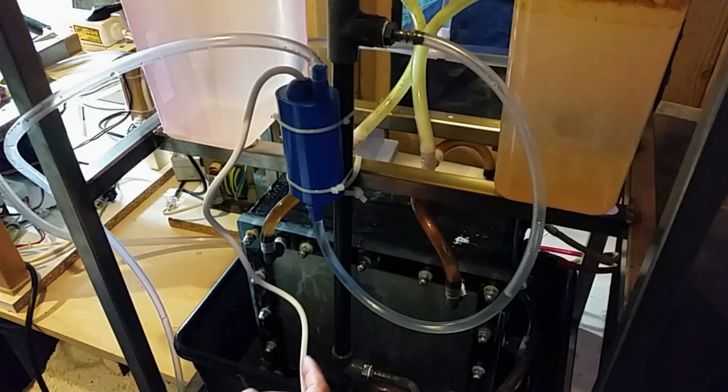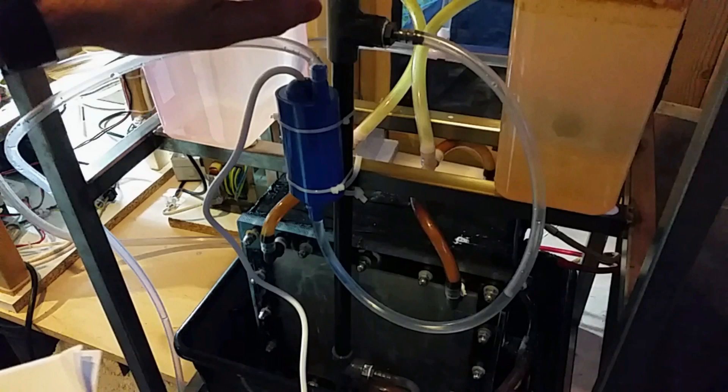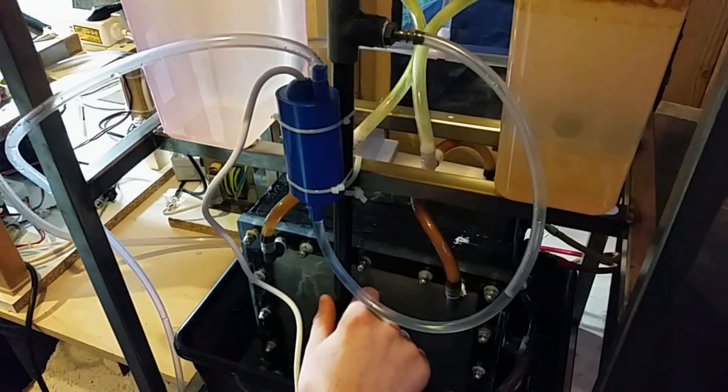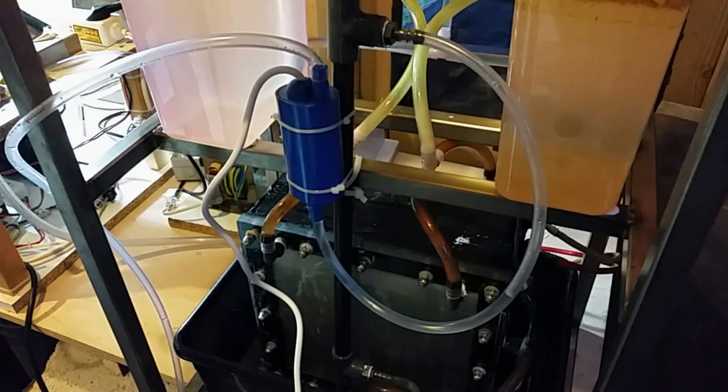To solve that problem I added this cooling tube, which is just a stainless steel pipe for the water to flow through. The return water from the tanks flows through this hose and at the bottom flows back into the generator. The stainless steel pipe has some PVC tubing around it for the cooling water to flow through, so the pipe and therefore the water will be cooled. The water flows in opposite directions for optimum temperature difference. I used stainless steel because almost all affordable metals will dissolve in the sodium hydroxide solution.